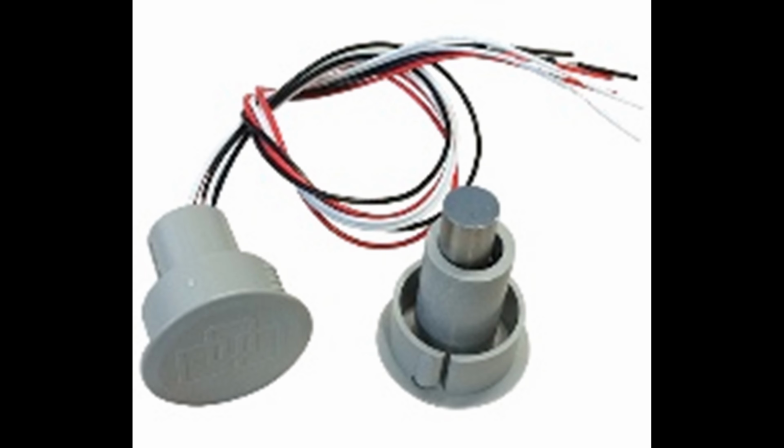Yeah, so you're going to need one of the common wires, and then the other wire is going to be normally closed, and you'll know that when you put your multimeter on there and check for continuity. When the parts are not together is when you'll get continuity from your common and one of the other 2 wires, because they're probably not marked. But checking for continuity is how you'll know.